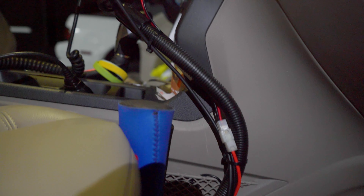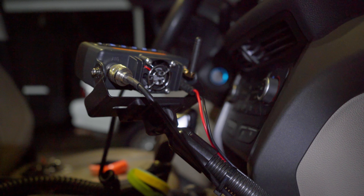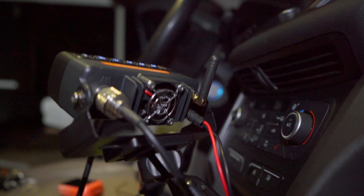As you can see, I've got the cabling nicely dressed, tucked up underneath all this paneling, so it's nice and cleanly run and looks a little bit more professional. I also zip-tied everything to the Lido mount. Power is now run to the radio, and I've also got the PL-259 running into the back of the radio as well.